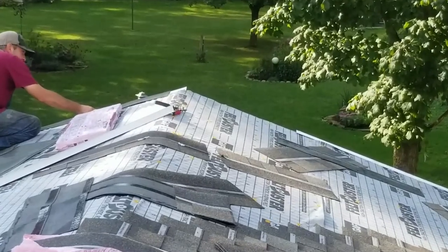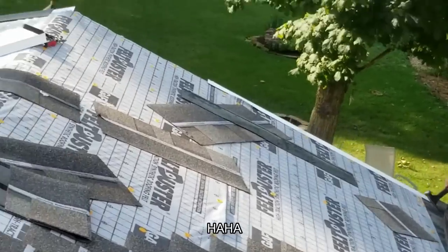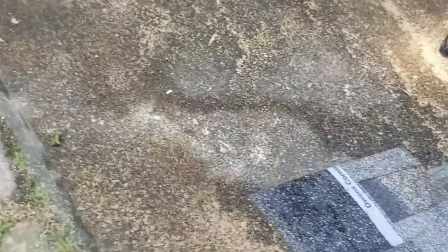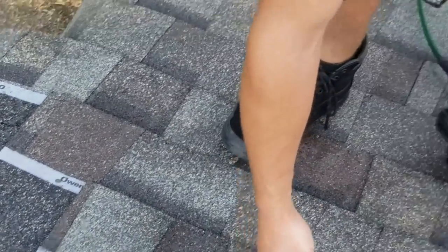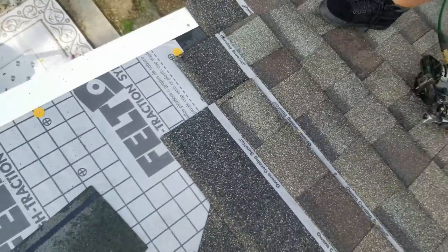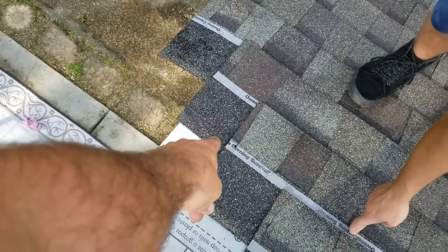Brad put that drip edge on high — he's gonna screw Boy Cub bad. Boy Cub, you put one on a little too close to the edge — and where's your starter? You little saboteur. Look how that end landed though. This other one's gonna be a really small piece. If you cut back right there your next shingle seam is on seam — that's why we always do one-footers. I'll let this one slide — I think you can put three good nails in this little guy and you're fine. Just get your starter on.